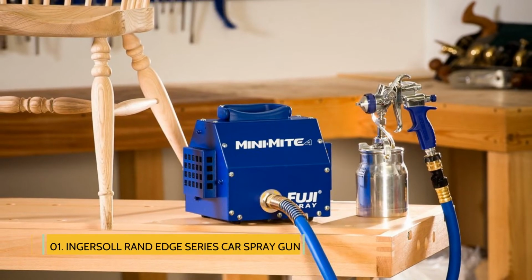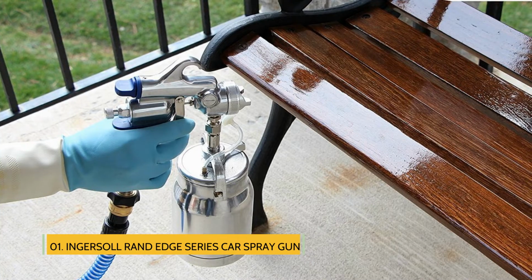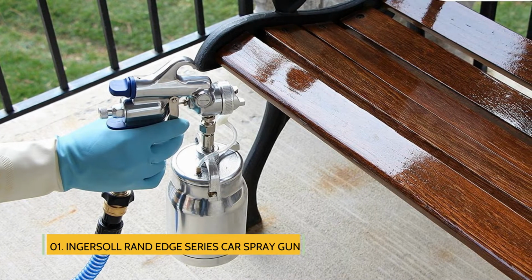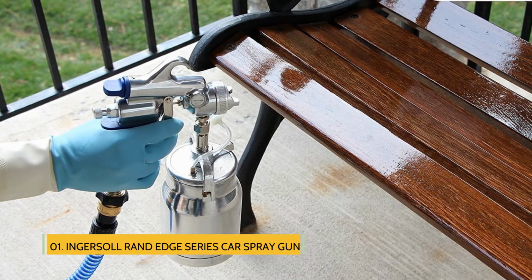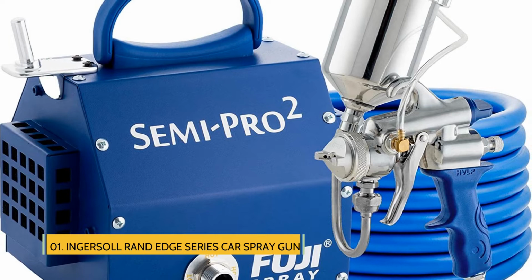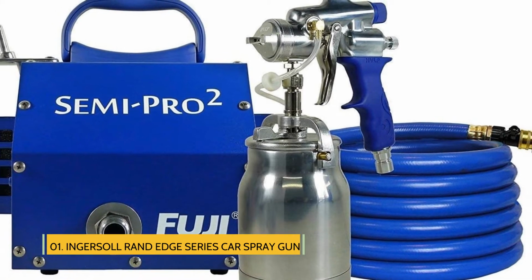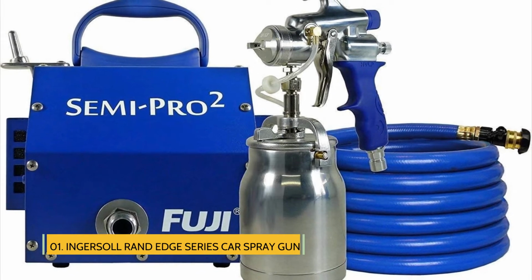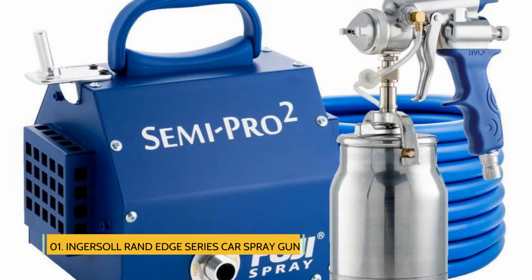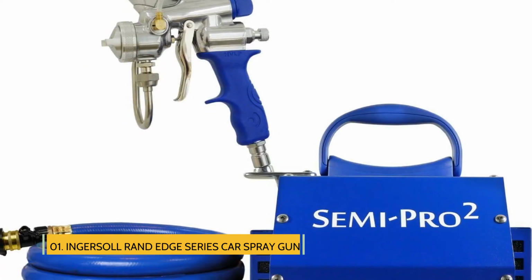Number 1. Ingersoll Rand Edge Series Car Spray Gun. The Ingersoll Rand 210G is another versatile spray gun with an air adjustment valve and an easy-to-use knob that allows you to choose the pattern and flow. This model features a gravity feed with an operating pressure of 60 psi and a 1.4 mm nozzle. It also has a no-drip cup and a suspension hook to store the spray gun once you are done using it.